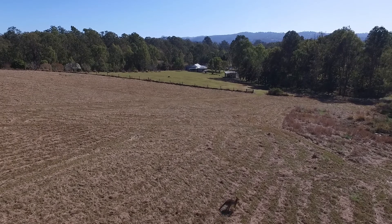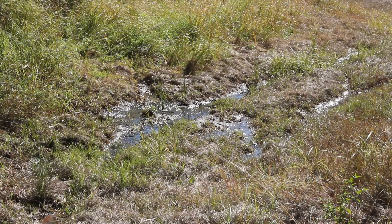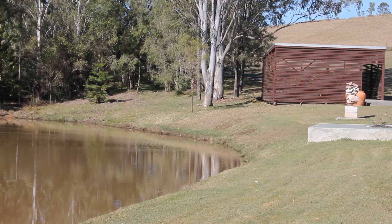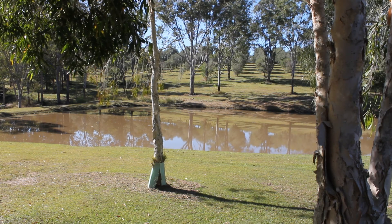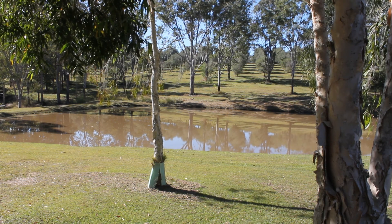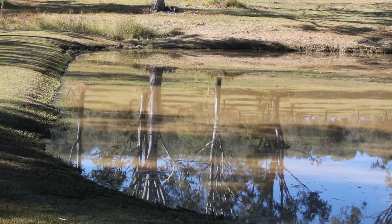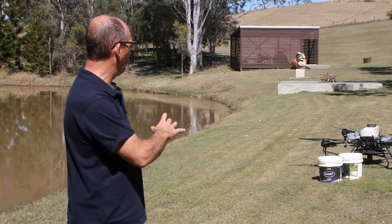The water is at its highest point, so there are obvious telltale signs of water leaking through the dam. Rather than treat the entire dam — and a lot of people have really large dams, an acre, two acres — and say this is going to be an expensive exercise, a good approach is to treat a localized area through the base of your dam wall, which is generally what we suggest. We've got the opportunity to do that today with a drone, and I'll just show you how that works.